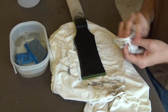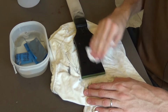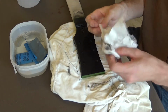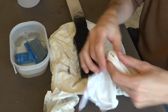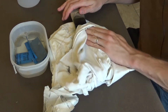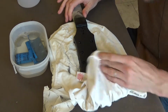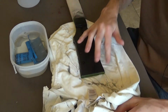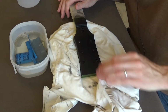So we have definitely removed material. There's still some pitting, presumably on the grain of the wood. This isn't really absorbing that well, so let's switch to a cotton rag and see where we need to be. Right, so it's definitely scuffed down. It's scuffed less than it was before, but hopefully that will mean it's ready for lacquer. It feels pretty smooth.